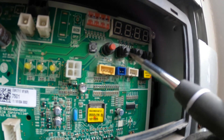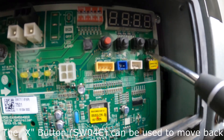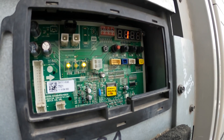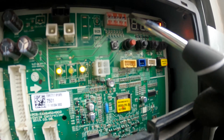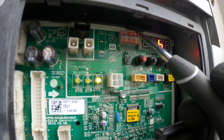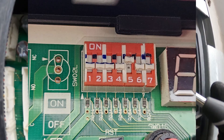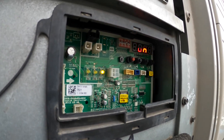There's an enter button with an arrow to the left, an arrow to the right to scroll, and an X button. Let's turn the power on and set this up. Power is back on and it went pretty much straight into an error code. Once the compressor tried to start, we had an overcurrent. We're going to go to dip switch five and press it up — any switch that is up is in the on position, any switch down is in the off position. We click five up and go into function mode. As you can see, it now says F-U-C indicating function mode.